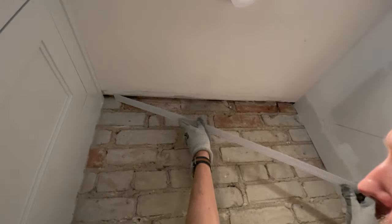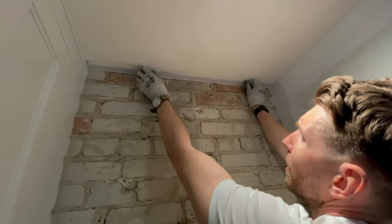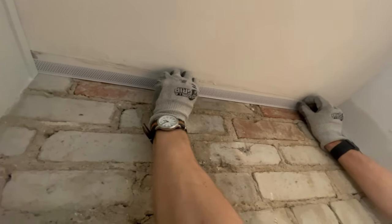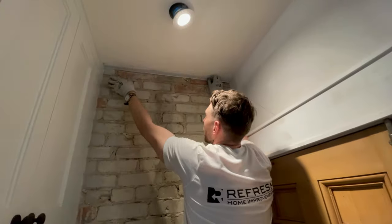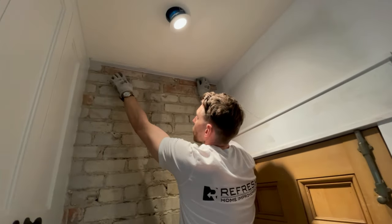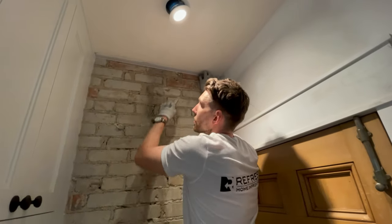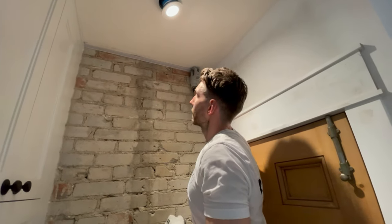I'm going to slide it along the ceiling to bridge the gap between the wall, and when I mud this in it's going to give my drywall the appearance of meeting the brick perfectly with a nice solid rigid vinyl edge. It's more rigid, it's going to last longer, and this way you don't actually have to join these two surfaces — so there's no risk of this edge cracking. If you tried to just mud it and caulk it, eventually these two surfaces will shift at different rates and you'll end up with a hairline crack. This way you leave them separate and it looks clean, finished, and it's going to last.